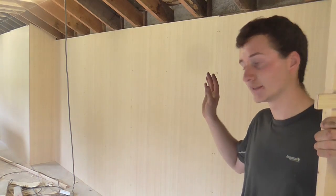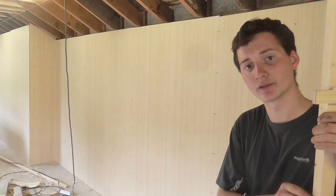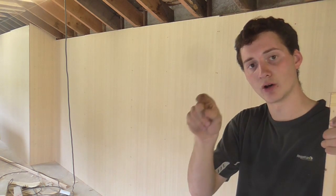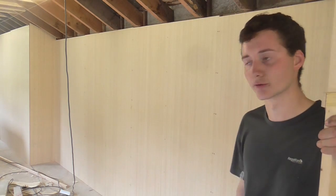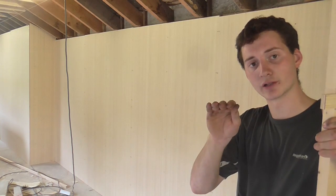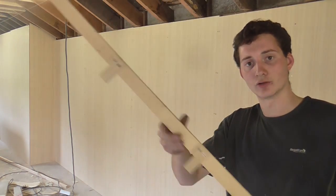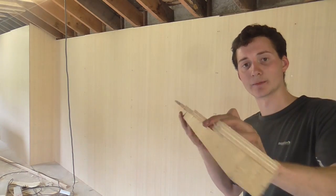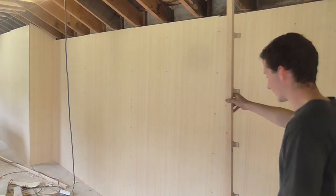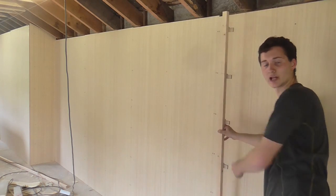I'm now just fitting the plywood panels and I've found that it makes a neater job if I put the countersink in first, then drill the hole, then put the screw in, otherwise it starts to peel the grain off. To get all the hole positions the same all around the room I've come up with this thing which I'm going to call a ladder jig — it's basically a piece of wood with a load of bits screwed on it and you just rest this against the wall and then rest your countersink on all the shelves.